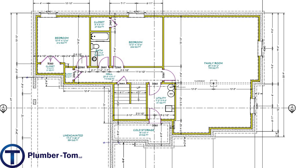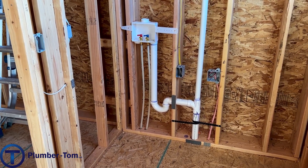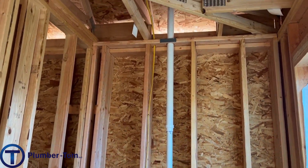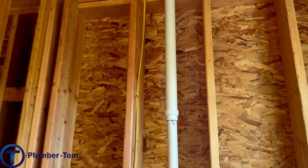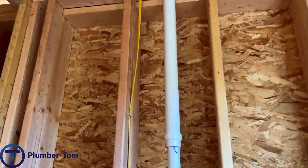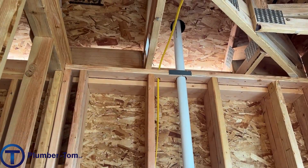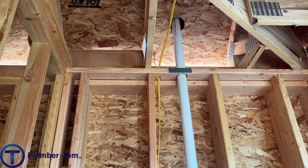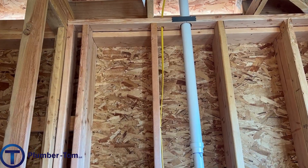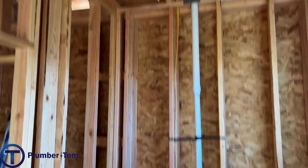These are the laundry room washer pipes — there's a washer box stand pipe, all good. One thing I really like is that this plumber brought a 2-by-1½-inch reducer on the vent well below the upper plate. That's good because if we have frost — and in this area things can get cold enough to frost into the vent pipes — you're required to have one foot below that upper plate into the thermal envelope. Really good job bringing that down in here.